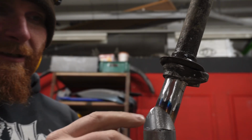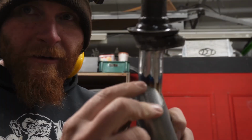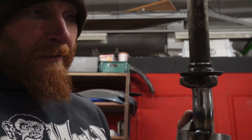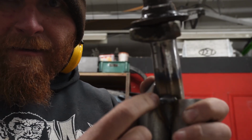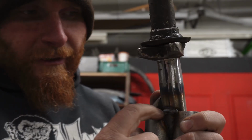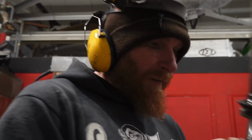Obviously, if we were to weld this on, then I'd bevel the edge of it. It fits around there nice where I belt sanded it now. But I think we can get it better. We got that gap by there. So I think if I cut another one, I can continue it onwards a little bit, so we don't have to put another piece in there as well.